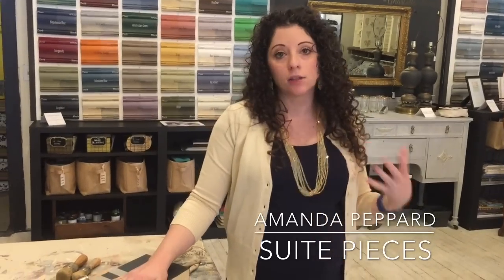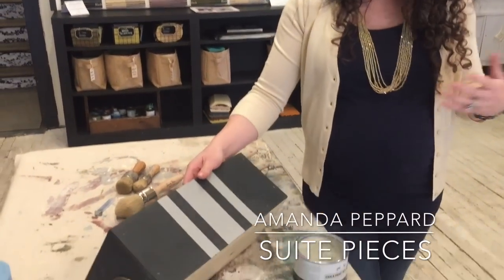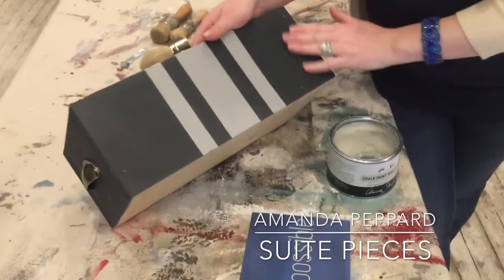What I love about the wax as well is that it's easily touched up. If you get smudges, scratches, or whatever on any piece — maybe you had a lamp there and didn't let it cure for the five to 21 days we recommend, and it created a little indentation — you literally just take a little bit of wax on your rag and buff out the spot, and it's completely fine. If you had used polyurethane and got a chip or a scratch in your finish, you'd have to redo the whole piece. It's so much easier to touch it up when you're using wax as a top coat. The wax is incredibly durable. Once it cures and hardens, it has this beautiful shine that you just can't get with any other traditional top coat products — that beautiful satin shine. It brings the paint to life and gives it this beautiful glow.